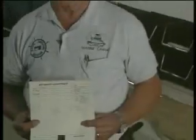Consequently, if you add those two up, they come to less than 240. What that tells us is that we're going to get this out of a 20-foot length of tubing, so we charge the customer for a 20-foot length of tubing for this top. So now I'm going to show you how we go about laying out the tubing, marking it, cutting it, and bending it.